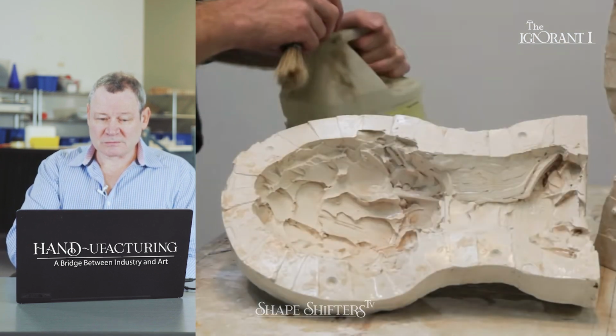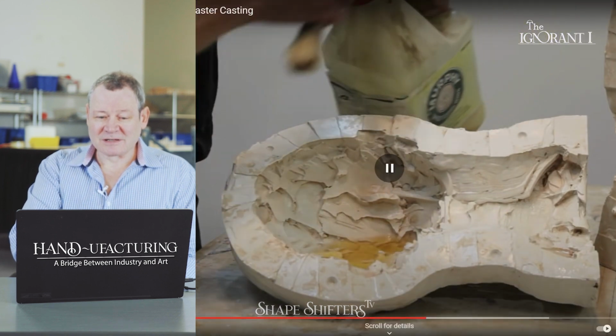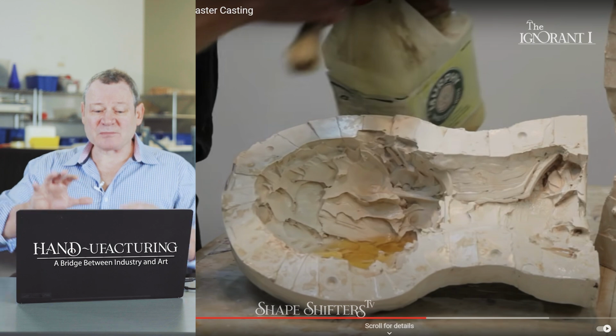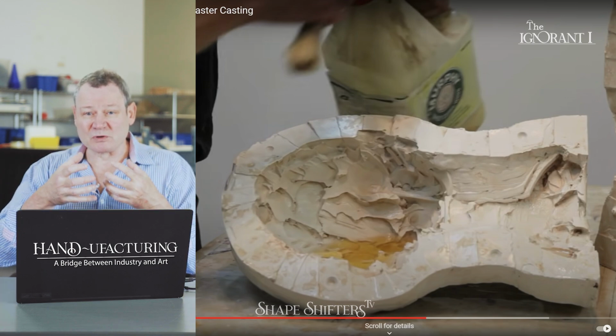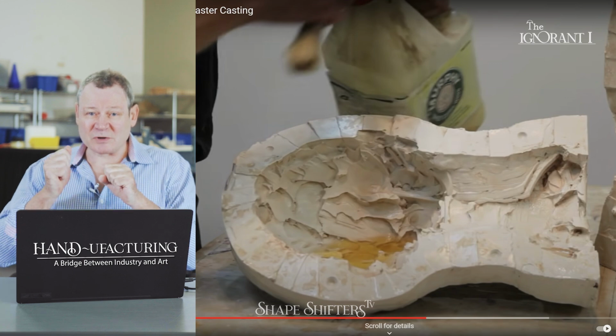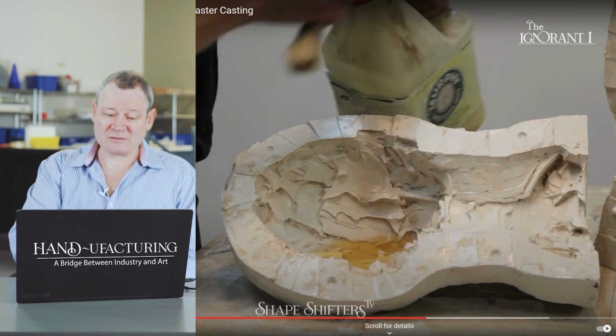Once you've soaked the mold, you want to then pour some Murphy's oil soap into the mold and then use it. This is the one time that I'm okay with the Murphy's oil, because you need a heavy release agent on the inside of this waste mold. He's going to pour plaster into this mold when it's closed up again, and that plaster is going to go into every nook and cranny and want to bond into a mechanical lock, and he's going to chip it off. So this soap has to be heavy. Don't mess this up. Your whole work is gone.